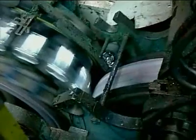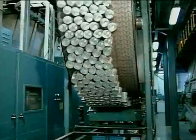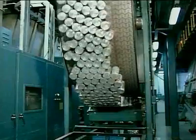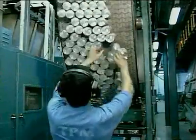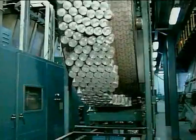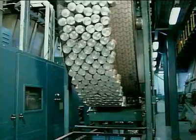According to the customer requirements, the base of the can could receive a second application of lacquer. The cans are then carried through the decorator's peg oven to dry and cure both the inks and the base rim coating. Visual checking is made easier by looping conveyors at low-level inspection points. The decoration operations on the back end are now complete.